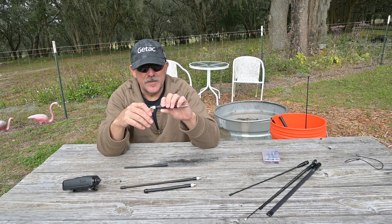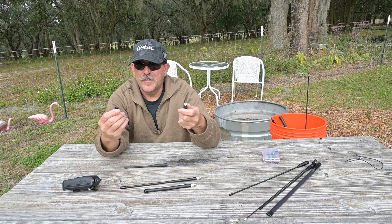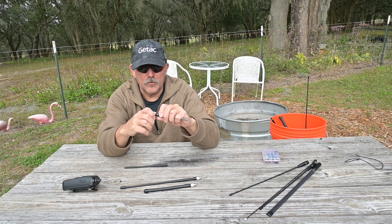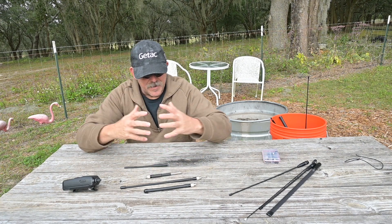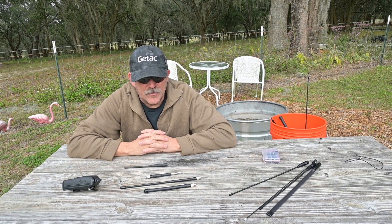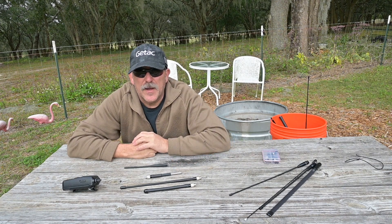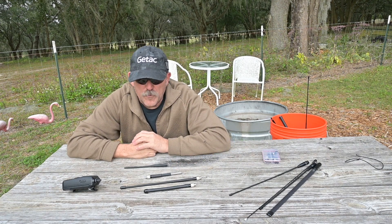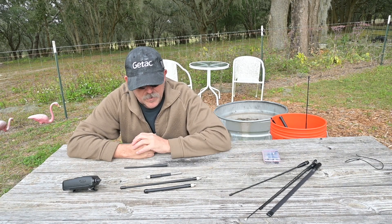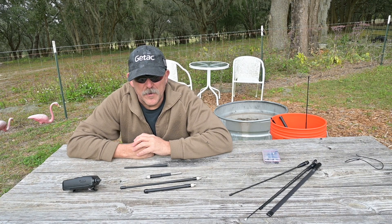I really like the Smiley antennas and I've used these for several years. You can change the RF connectors by just spinning them off and reusing the whips on other particular connectors. They also can handle 50 watts of RF, which is impressive. You'll see in testing that these antennas actually favor the amateur bands of 144 to 148 MHz, whereas many of the other antennas tested favor the commercial spectrum.